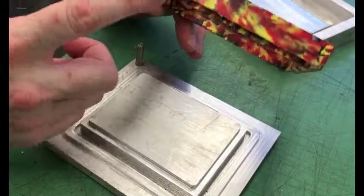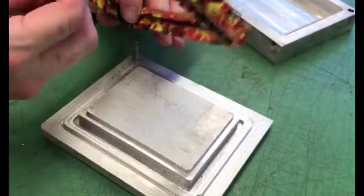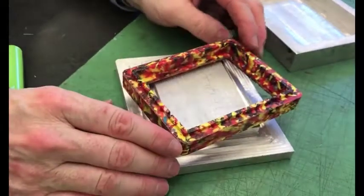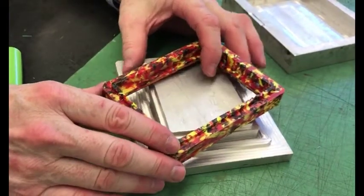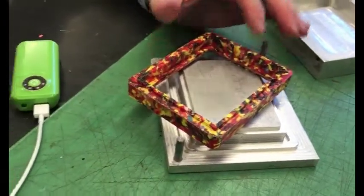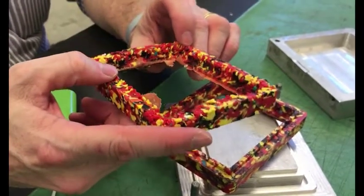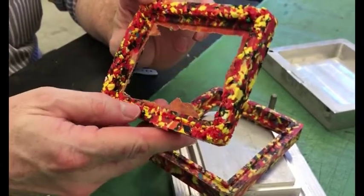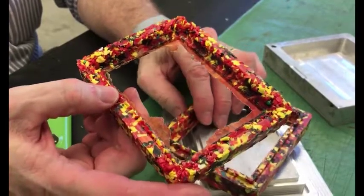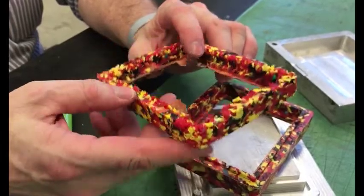Anyway, this kind of shrunk on there, but we don't have a good place for an ejector pin. It worked pretty well — we didn't quite have enough plastic, but we put in shredded plastic, loading by hand, and that one looks better. Here's another one where you can see we didn't have enough plastic, and then it solidified. These were done close at the same time, same batch of shredded plastic.